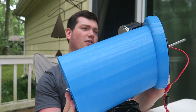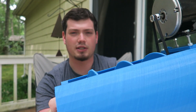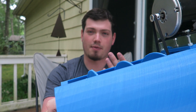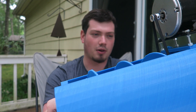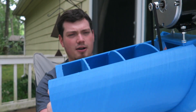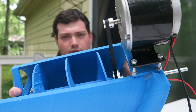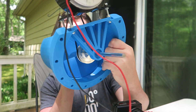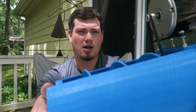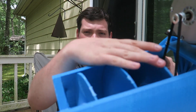This is the motor that we use on all of our projects. I'll get called out if I get this wrong — this one isn't labeled, but when I bought it, it was labeled as a 350-watt 12-volt DC motor. My other one is the exact same thing but labeled as 250 watts. We've never seen an output that high, so I'll call it the 250 to be on the safe side. We have a 20-tooth GT2 pulley on the shaft of the motor and an 80-tooth pulley on the shaft running through the Archimedes screw, giving us a 4-to-1 ratio.